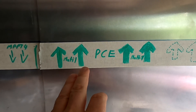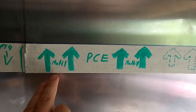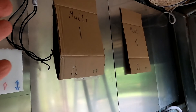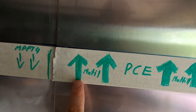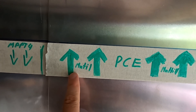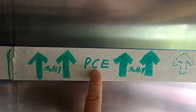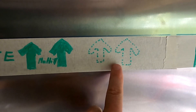Next to it will be the output of our bus bar, where our load is connected — in this case two inverters. Thick 70mm cables come out to our PCE — power conversion equipment — and potentially a third inverter in the future.